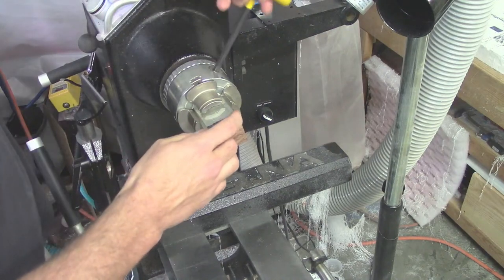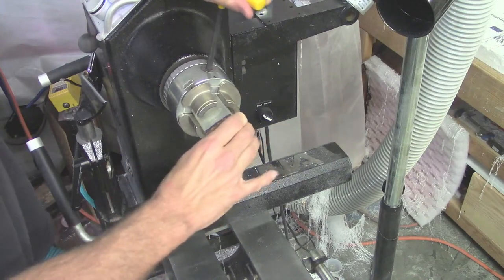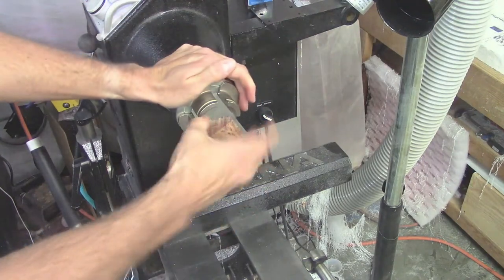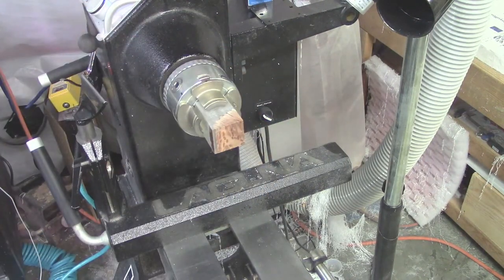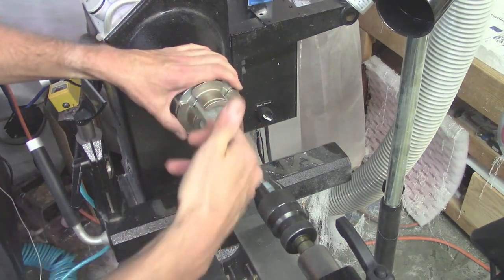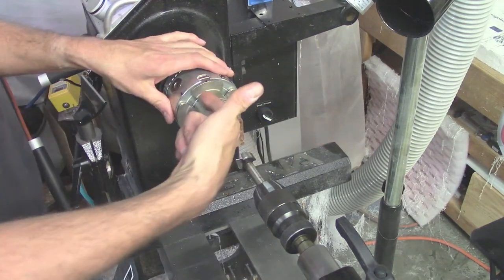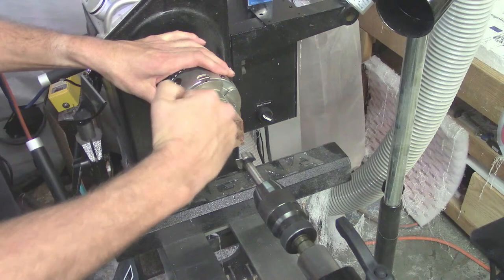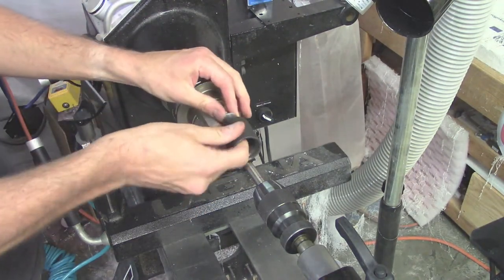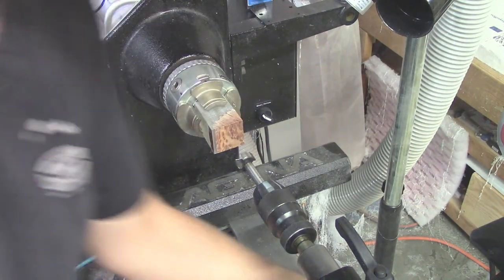I'm just going to get that ready to go. First thing I'm going to do is square up the bottom of this blank. Make sure that's good and tight. It's not necessarily dead square, but we'll be good to go. I'm going to hit it with a Forstner bit, and that'll just carve out a square, flat surface. Then when we come in and drill and tap the threads, we're good to go. It'll mate up perpendicular, so it'll fit on this perpendicularly. There are no gaps or anything weird going on.